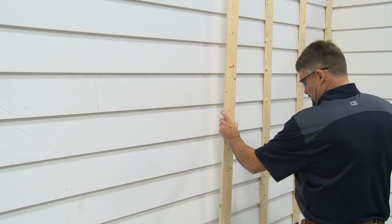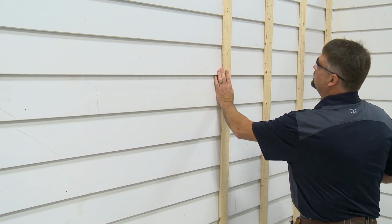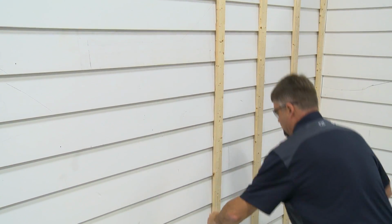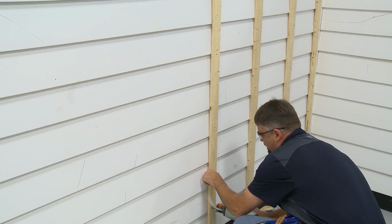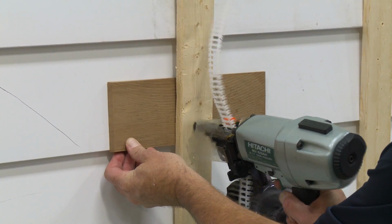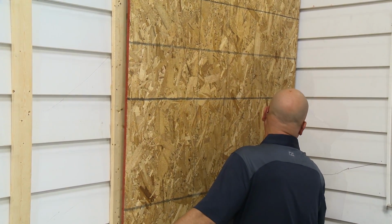Option 3. Apply vertical furring to old siding to straighten noticeable surface unevenness. For best results, space vertical furring strips 16 inches on center over studs. Do not exceed 16 inches. Use wood shims if necessary to eliminate low spots. Then apply rigid sheathing suitable for new construction.